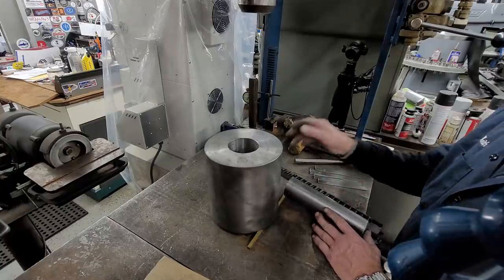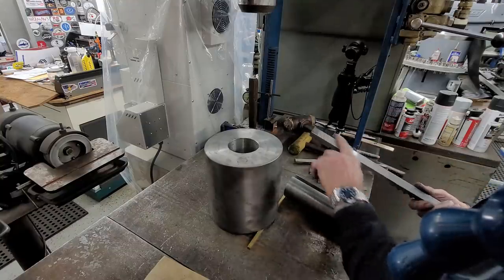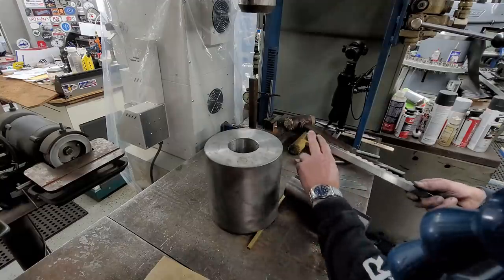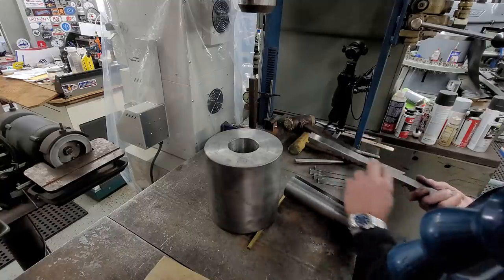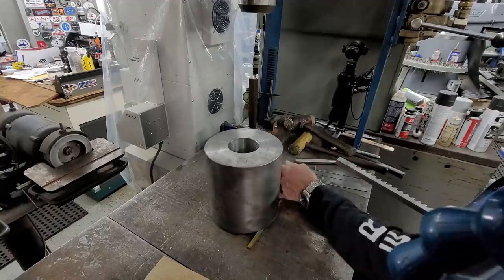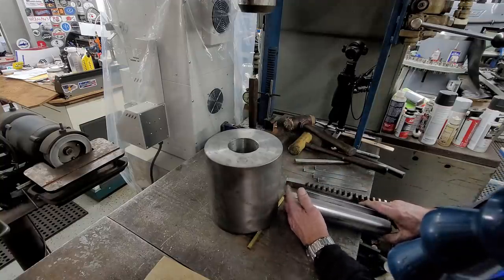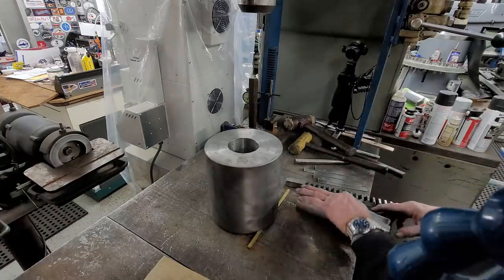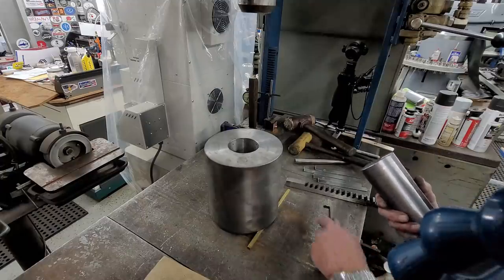I don't know exactly what caused it, whether a piece of crap got in there, or this was just too sharp and my corner wasn't sharp enough. It doesn't hurt to have a relief on these two corners. You're pushing against the back. In fact, after you put a shim in here, your shim is rattling in here as well, so it's not tight to the corners. So at least I know I'm not going to be touching tight into the corners again. All right, so I do have shim here. We're ready to rock and roll again.